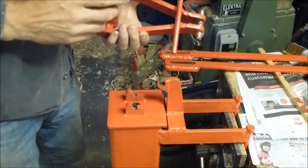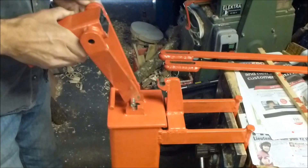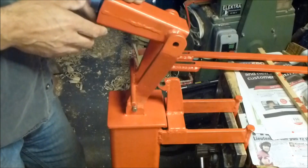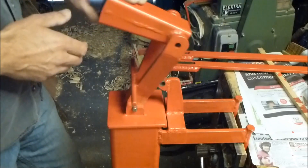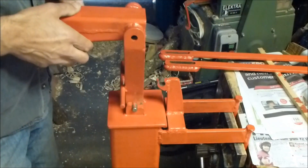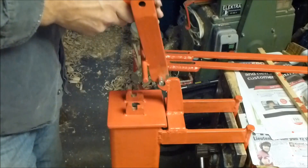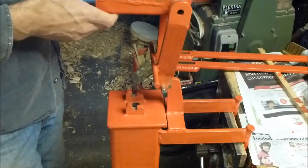Next we have the operating lever, which will eventually have a wooden handle attached. The key thing about this design is that the fulcrum for the lever is directly on top of the cap, directly in line with the action up through the piston. This will create a force which will always hold the cap down without any need for extra clamps. The operating range will be from about here up to top dead centre on the compression stroke. When used to eject the briquette, the lever is moved to this alternative fulcrum and again operates from about here up to top dead centre.